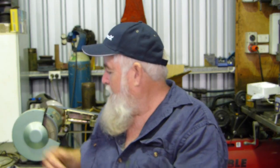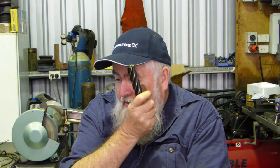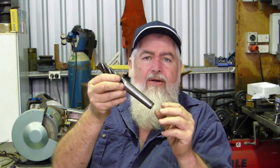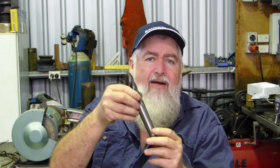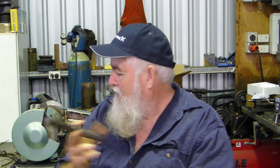We'll just see how we go with that — it'll be some time before I actually get to do it. The limitations with that is I have some Morse 3 end mills, and they would — well, I could make an adapter. If I made an adapter from an ER32 collet, or you can buy them I believe, a Morse 3 female socket with a straight three-quarter end — it'll probably be half-inch — but by the time it gets way out there it may be too much sticking out. We'll think about that as we get closer to doing it.